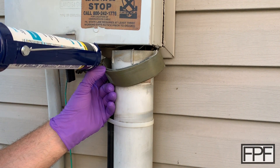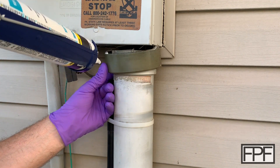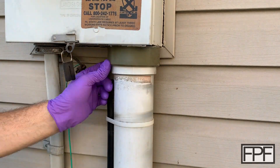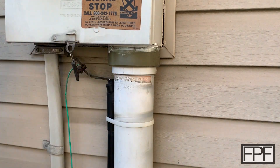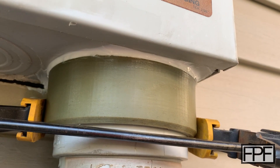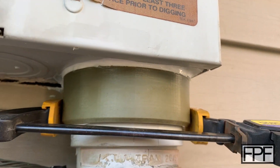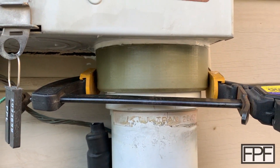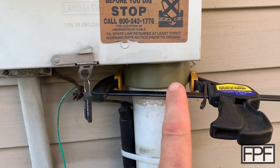I'm going to be very liberal with my application here since it didn't stay in place last time — well, it did actually stay in place for probably two or three years, but I don't want this thing to come off. I'm pretty pleased with how that came out. I left more of a gap up there this time so that I could fill that gap with caulk, have a little bit of flexibility, and also just more surface for that caulk to adhere to the bottom of the steel box. This stuff goes on white but it's going to set up nice and clear. I'm going to share the STL for this, like I do all the designs I review on this channel. So if you've got the same issue outside your house, you should be able to fix it up with one of these TPU rings. And let's go take a look at the design.